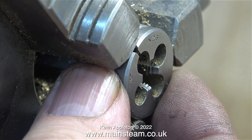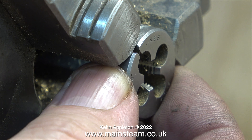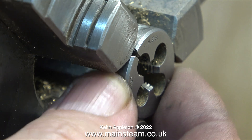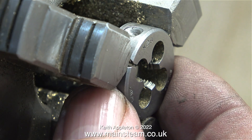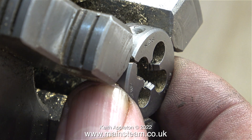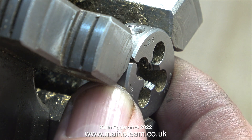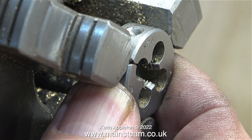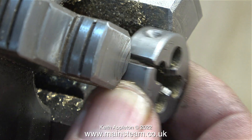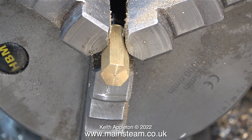There are different ways of threading in the lathe. You can use the gearbox and actually screw-cut, which I only tried once and it turned out like a strand of DNA, so I gave it up. You can also use Coventry die boxes, but most people like myself use commercial dies. In this clip I've changed the position of the die so the chuck jaw is on the part that spreads, but the same thing still happens — when you tighten up the jaws, the die gets smaller.